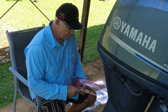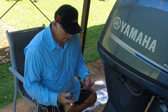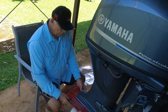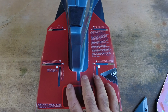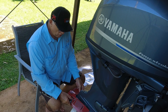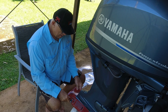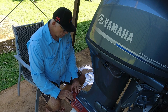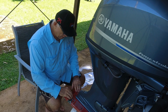What these things come with is a mounting plate template. You fit that to the back of the engine and fold it around your cav plate. All you do is line up the squares, or line up the lines with a marking pen, and you've got the perfect spot to drill your holes. It's a really simple install — this is a great idea.